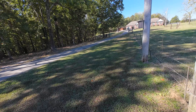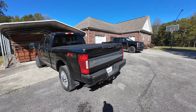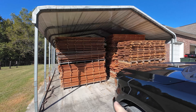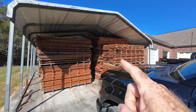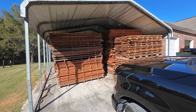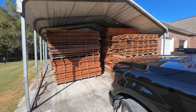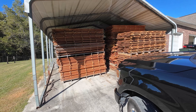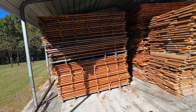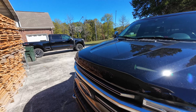Let's walk up to the house. I have a carport, open-sided, and what's under it? Is it my pickup trucks? No — it's my lumber. Some of it anyway, because this is probably one of the best places on my property to air dry wood. Instead of my trucks being parked in here, I've got it slammed full of wood, as full as I can get. Open-sided shed, blocked by the house from the north wind for some species. I get a good southerly breeze, and it's protected from the southern sun most of the time. This is my cherry and walnut spot — it loves it. My trucks are jealous because they're outside.